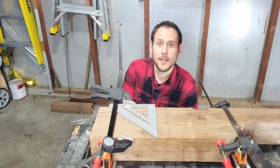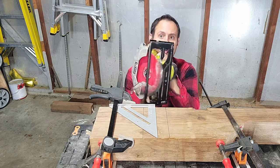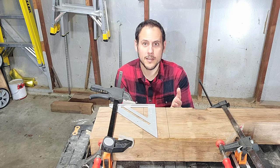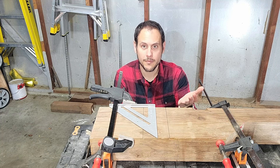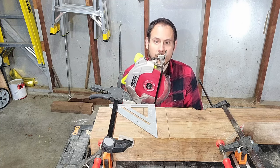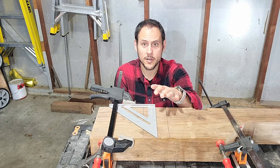I'm going to use my first tool, which is my circular saw. For my circular saw, I set the depth at one and three quarters inches. Since I'm doing half the stock for my crosslap joints, I took a 4x4, which is actually three and a half inches. Half of that is one and three quarters. So with the depth set as well as the pieces clamped together, I can go ahead and start cutting.